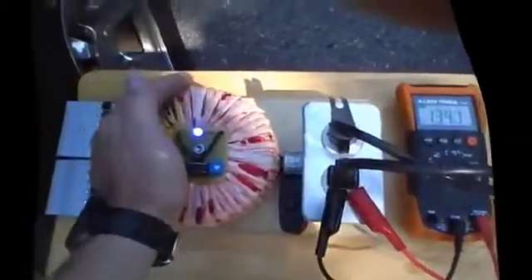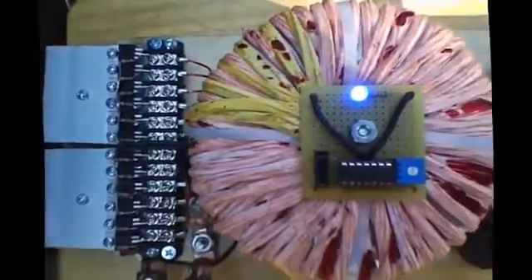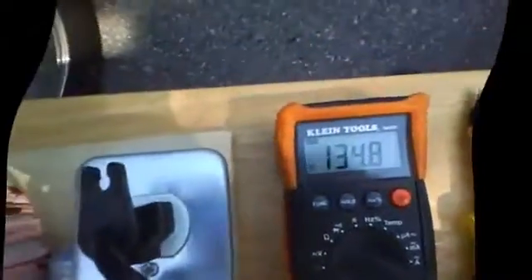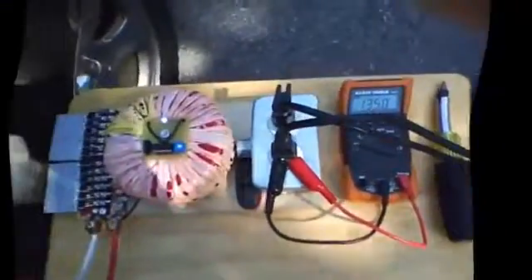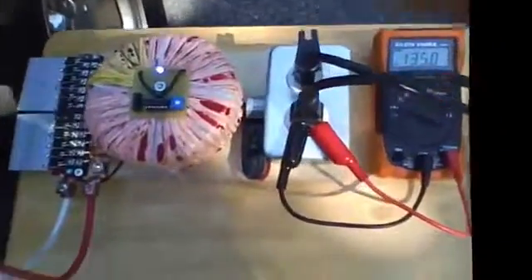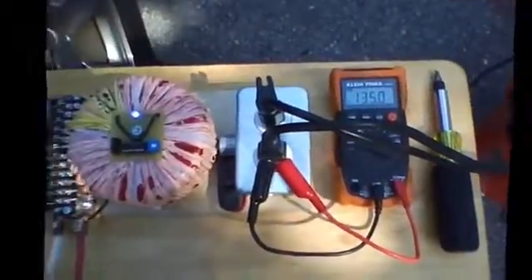There's your circuit — you can hear it when it's just on standby mode, the 60 hertz cycle pulsing. We're at 134 volts right now, almost 135. It all depends on your alternator. You can see my alternator here — it is not a high amperage alternator at all. I'm guessing around 45 to 50 amp max from the magnet wire I see here. It all depends on how high of an alternator amperage you have on your truck — this thing would work great and just push out the power. If you have any questions, just let me know. Thanks for watching.